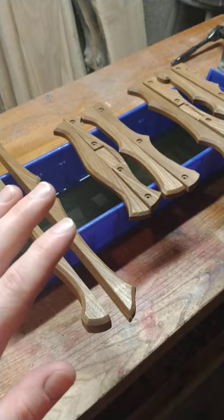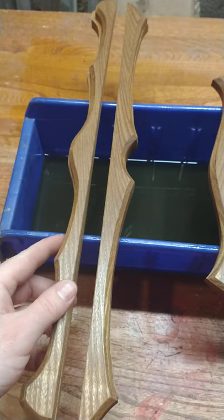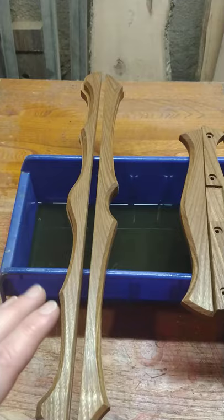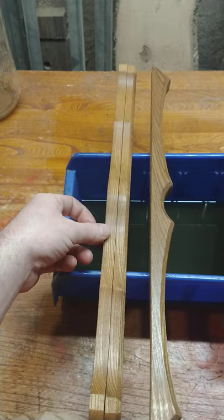As you can see here, each block of four is going to be a single frame, and each one was cut out of a single piece of red elm. That is what the block would have been — just a big rectangle like that. So what I'll do is I'll trace out the design, I'll cut it out, I'll get all the finishing on it, make sure it's nice and sanded. Then I'll cut it down the center first, and that way we've got the flat face that we can put down on the table and get the measurement for ripping straight through.